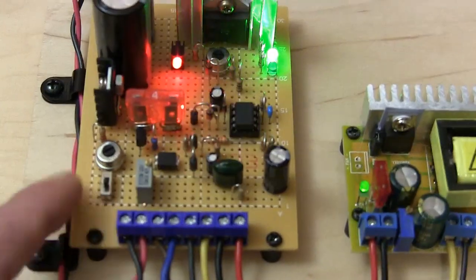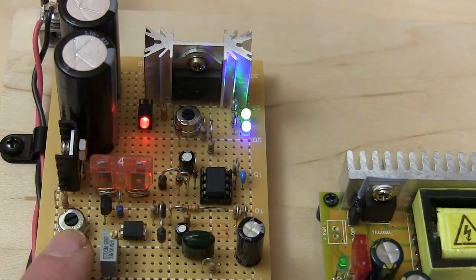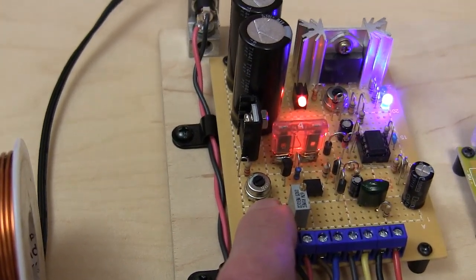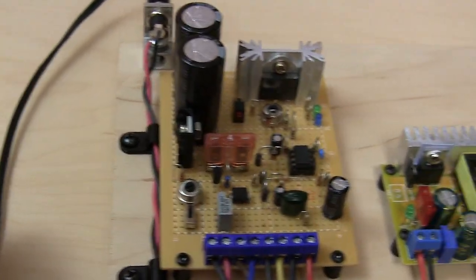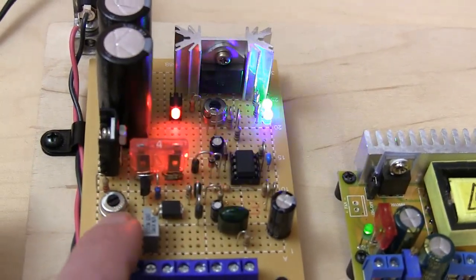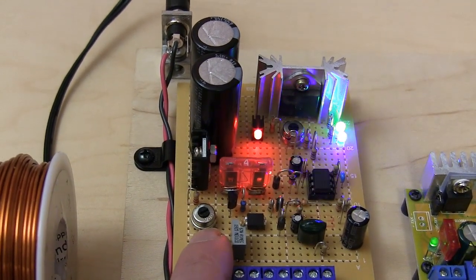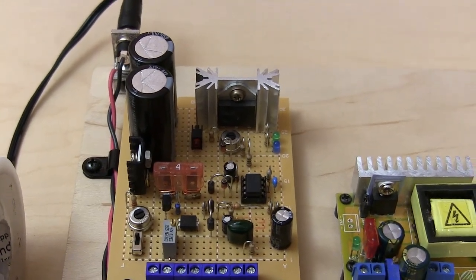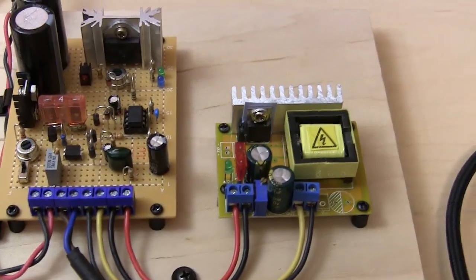Check this out — it's really neat. No matter what part of the cycle the circuit is in, it doesn't matter. You shut it off and it actually discharges. It just automatically discharges if there's voltage in the capacitors — it doesn't matter what part of the cycle it's on. That way you avoid getting shocked, because the capacitors do have 375 volts, or all the way up to 450 volts depending on what you're using. The capacitors are rated for 450 volts.